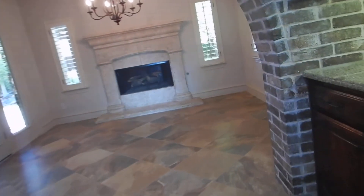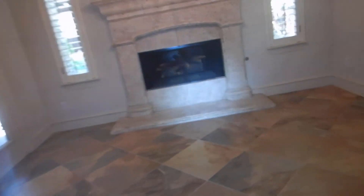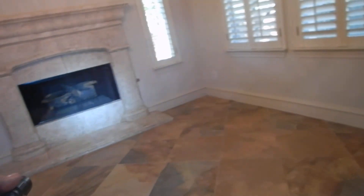When you've got a big vent fan like this that really sucks, without makeup air in the kitchen you're going to draw air out of your fireplaces. If your fireplace is being used and you turn the kitchen vent fan on, it's going to suck air backwards out of the chimney — past the fire, carbon monoxide — into the house. It should have some way to equalize the pressure if you're going to use any one of these fireplaces.